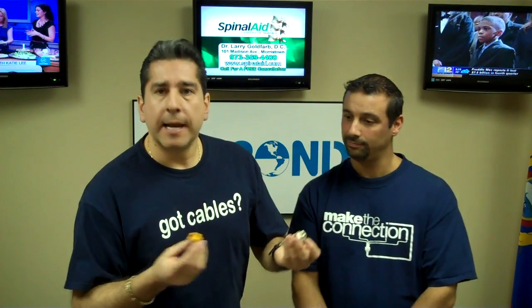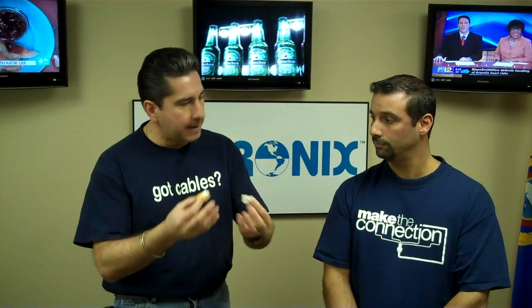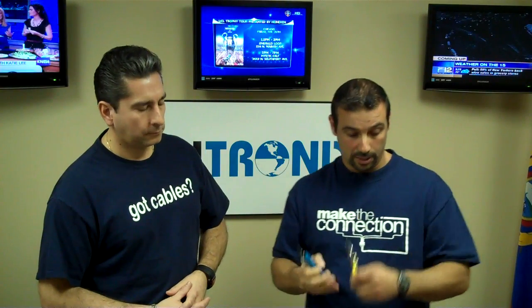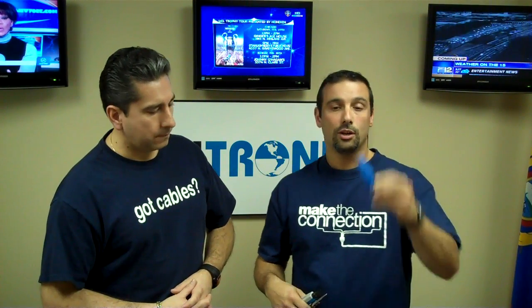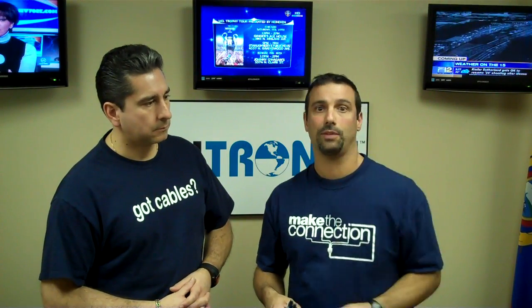A couple things I'm going to ask Ted: first off, what do I need if I want to properly install a keystone jack, punch down the cable, and do a nice finish? Well, that's quite simple. First and foremost, you're going to need a punch down tool. You're going to need scissors. Again, it's a matter of preference — what you feel comfortable with, what's going to get you through it quicker and more accurately. You can also use a stripper that takes the coating off the cable.